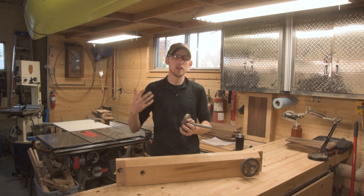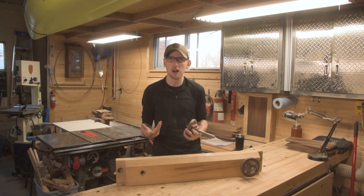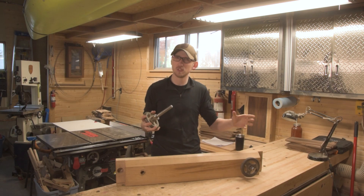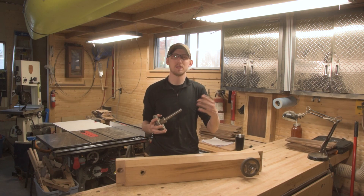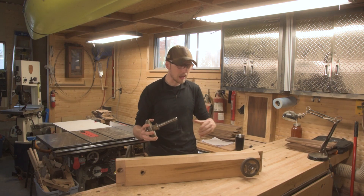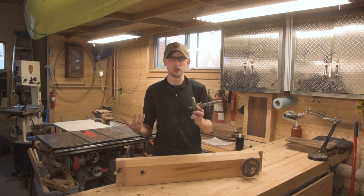What I've been trying to do is find a rod long enough to hold boxes — so if I need to hand plane the side of a small dovetail cabinet or a small box, I can just mount it in the moxon vise. Finding these longer rods can be kind of challenging depending on where you look. I had some longer ones on order but the companies I've tried to deal with have all been a little bit weird, so I haven't gotten them yet. But the 8-inch rod that comes with the Benchcrafted kit is perfect for holding anything up to about 8-quarter thick stock.